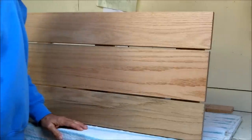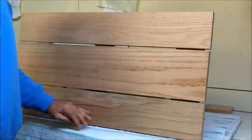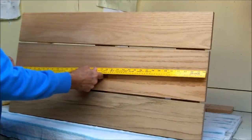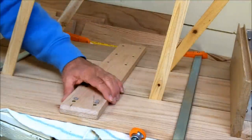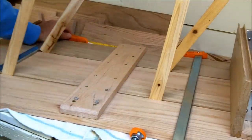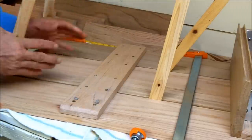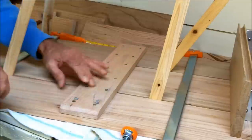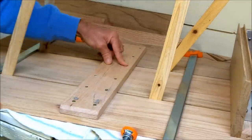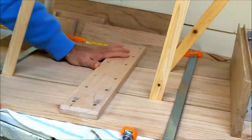In designing the bed of the wagon, I used oak planks — a 6, 8, and 6-inch wide piece — and I decided to make it 36 inches. I glued a center 4-inch board in the middle of the bed on the underside. I held the boards in place with clamps, used a shim to keep the board separate, put glue underneath, and put four exterior grade ceramic coated star drive screws to hold the board solidly to the underside of the bed.